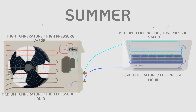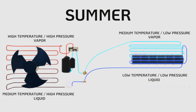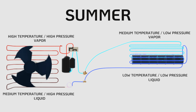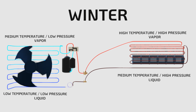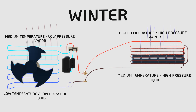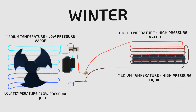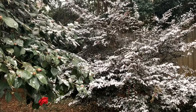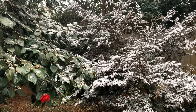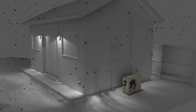Here's a simplified visual to show all of the elements of the system together in one place. One of the coolest things about this system is that it's reversible. Remember that four-way valve from earlier? Using that, we can change the flow of refrigerant, so we can also use this unit for heating. We'll instead absorb heat from the exterior air and release it inside. This is how a heat pump functions, and it's very efficient because we're just taking existing energy and moving it. Although the colder it is outside, the harder the system has to work since there is less available energy — and if you live in a particularly cold climate, some heat pumps can't keep up, especially if the home isn't well insulated.